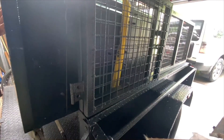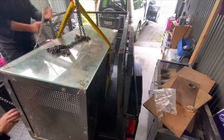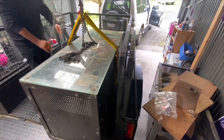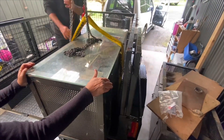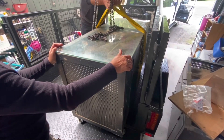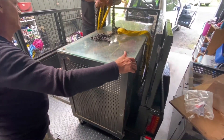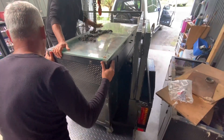The other thing I'm doing here is reversing the trailer underneath the tool chest, so I wasn't swinging the tool chest on the chain and block and tackle. What we did was reverse the trailer underneath it, then lowered it back down onto the trailer, and just pushed it forward. That way it's always nice and even. I was never trying to get the balance or the weight to shift while it was up in the air resting just on that one strap. That might be different if you had a fulcrum with four points lengthwise and widthwise, but I didn't do that, so I wanted to stay as safe as possible.